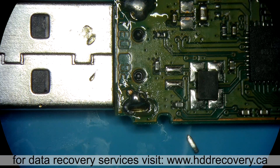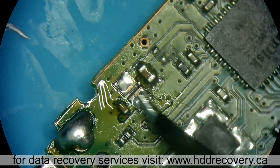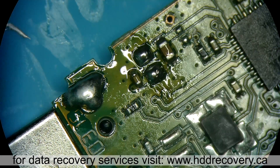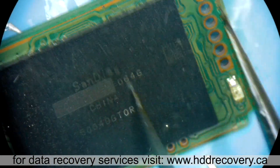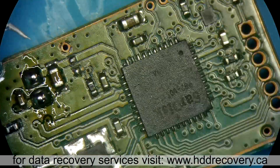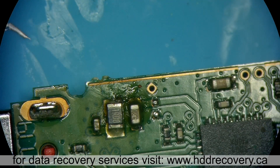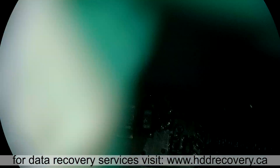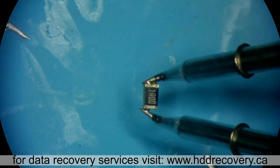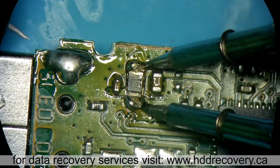Let's prep the pad for the resistor and work further in. That might be a bit too much solder — we'll clean it off if needed. I have a donor board here with that same resistor that I changed on the last repair. There's flux around it, so I'll gently take it off. Most of the time we get these with connector problems, but several times recently we've been getting them exactly like this — with this burnt resistor issue.